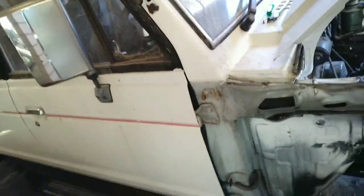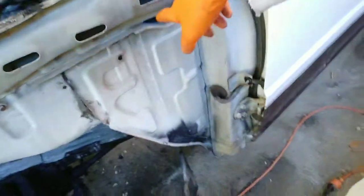Now, there isn't really much more to update other than the fact that we found some cabin holes. That was a cabin hole on that side of the car there. Then there's cabin holes in here, which mean any water that goes on the windshield goes into the grate, and then it comes out the sides, goes into the cab where your feet are, and eventually mold will build up in the carpet. So there are cabin entry points there, and in here, those points are pretty much unreachable. They're pretty minor, so we won't even bother trying to weld them up.